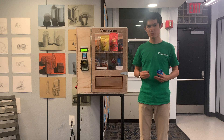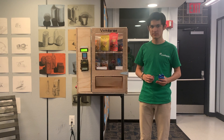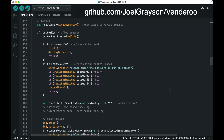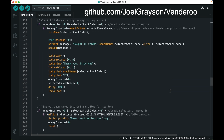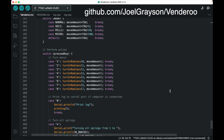The next part was programming the Arduino Mega to communicate with different parts. You can see the code on GitHub. It tells the Arduino to listen to the bill acceptor for when money is inserted and the keypad for when a snack number is pressed. When there's enough money, it turns the snack's motor.